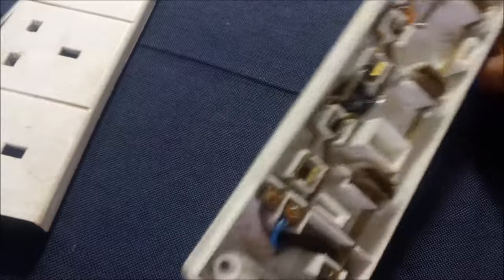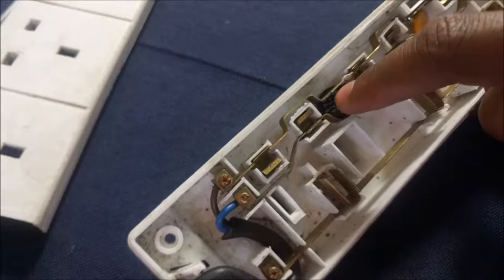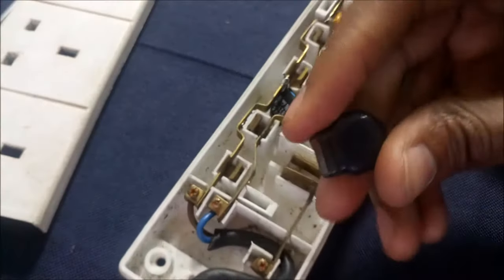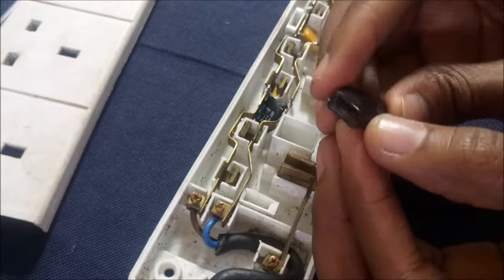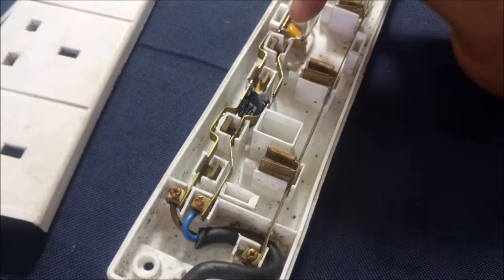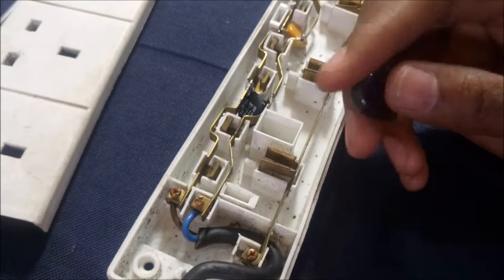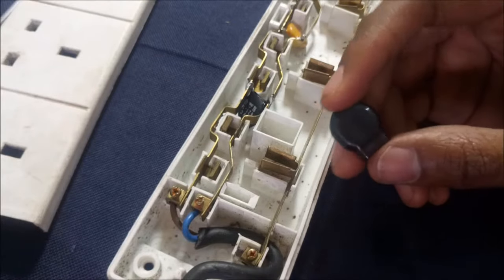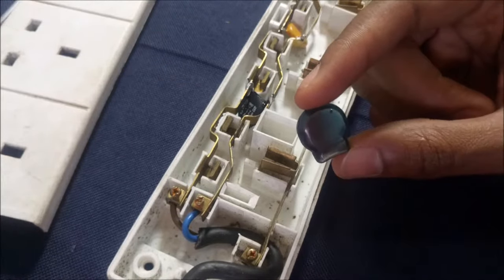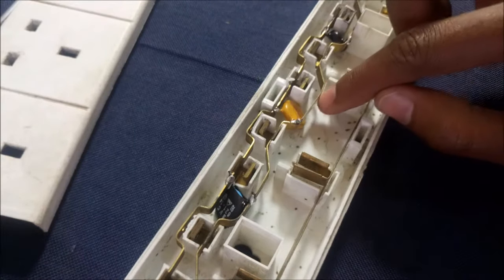So you might see some varistors have this cover on them. This one here is a rubber one. Also, this is a rubber. This is just to protect the other electronics in your device. They usually blow up with a big explosion. So to protect the flying fragments from damaging other electronic devices, they usually use a protective cover like this one or like this one. The reason for the explosion is the rapid heat that is generated inside the varistor as it breaks down.